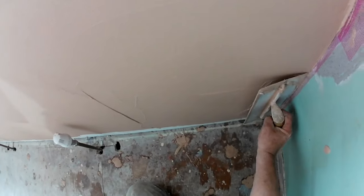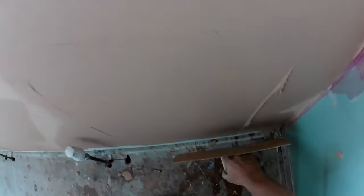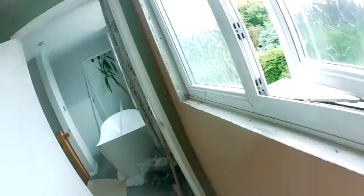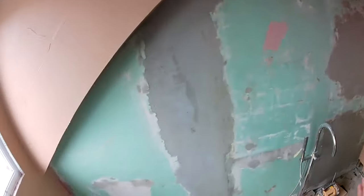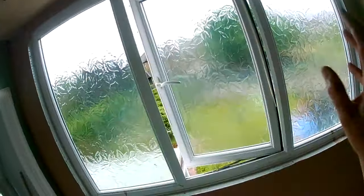Like I say, it was just tricky this room because there was all sorts of angles around the beads, the triangle, and them little reveals were only little nibs. It was over the door with the architrave on, so it was really tricky. Because the walls are pulling on this grey stuff, we've SBR'd and we've done all we can. Liam's going to have to put that on and lay it in quick before he moves on to his other wall. It's the same with me, I'm going to get my reveals on, lay this lot in and then put that on.